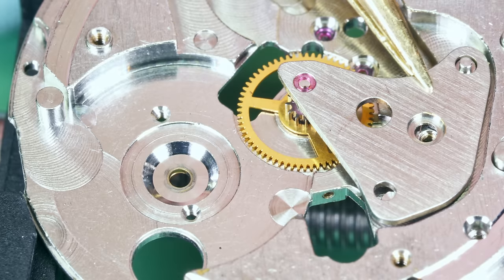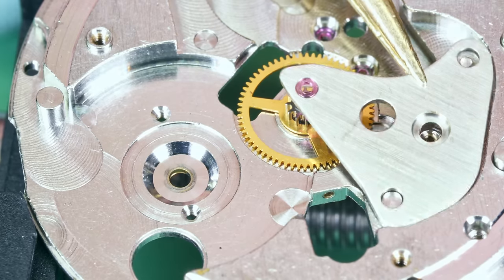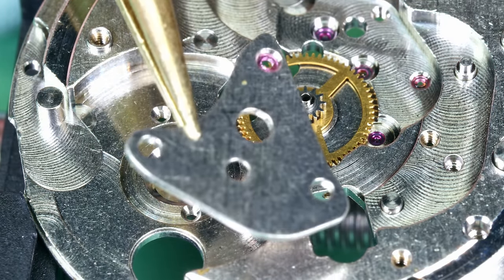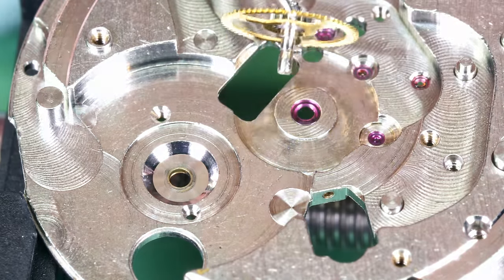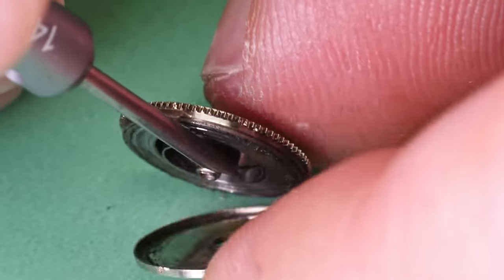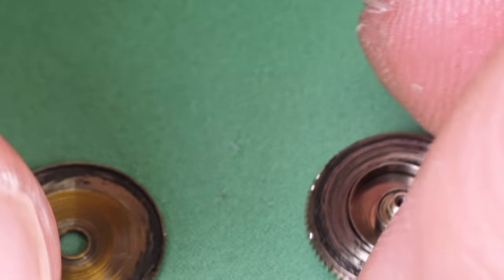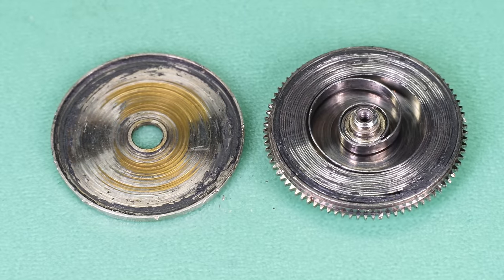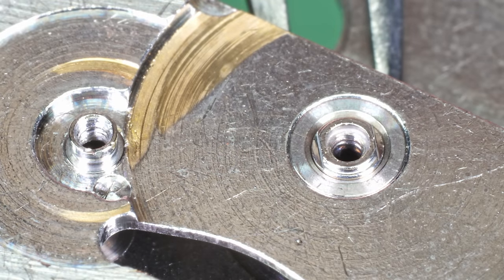It's always a good idea to remove the cannon pinion at an early stage. You don't want to have a loose center wheel and remove the cannon pinion in that state — it's better to remove it when the center wheel is secured between the main plate and its bridge. I'm going to go super quick through this section because my videos are really long. I did cover quite a lot about the differences between the Seiko and the general mainsprings in my last video — I'll put the link in the description. Okay, let's have a look at what's causing the wear.